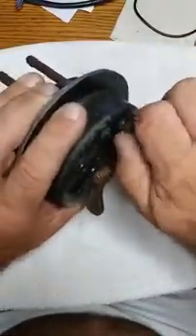Mr. Sunshine actually just impressioned the key. You take a blank, hit off about two-thousandths of it, and by sticking it in and wiggling it around — there are actually four pins with six depths, and the tolerances are so close that if you use a file and file one extra thou, the key is shot. So you're looking at a fifteen or twenty dollar blank thrown out, and you keep moving.